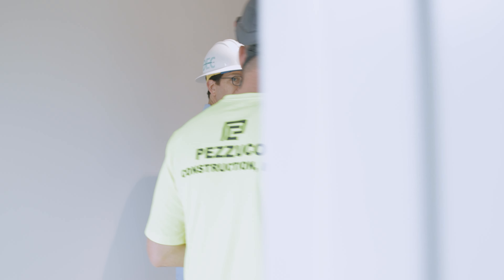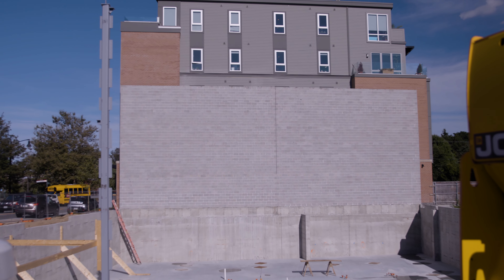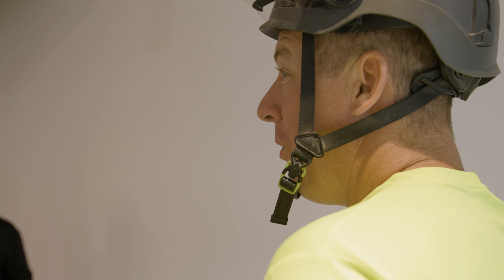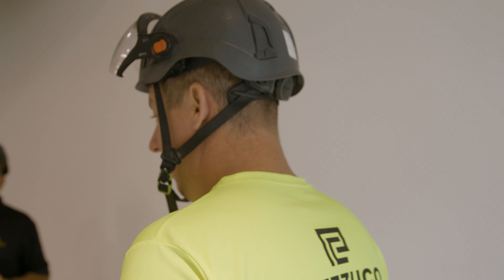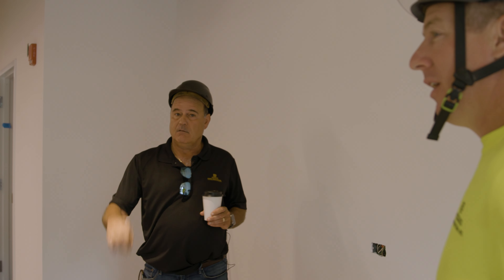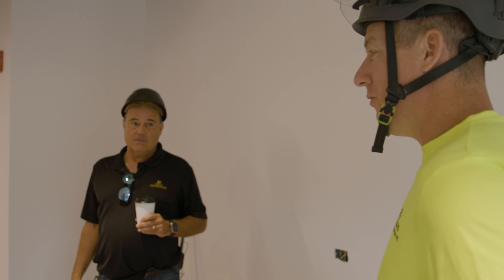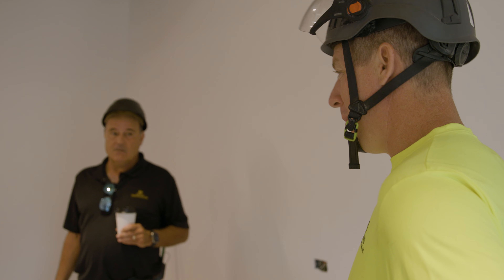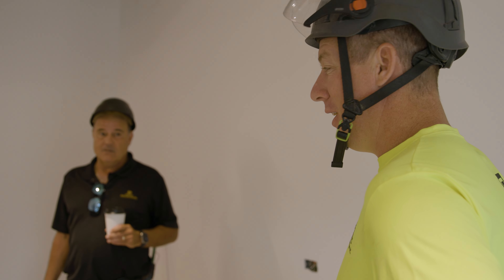I thought it was interesting that that wall was built all the way up. We had initially wanted to build it floor by floor. And Mason said no, we have to build it all the way up, and this is how I'm going to do it. We were a little nervous — that's a tall wall with no corners at that point. It doesn't have any corners, just reinforced steel. He said he'd build it in eight-foot sections, wait for it to harden, come back and build another eight feet, wait for it to harden again, and keep going until he got to the top.